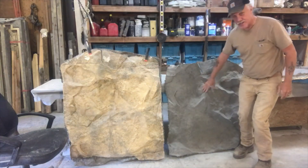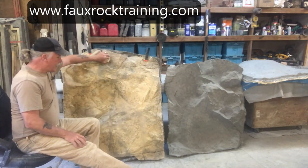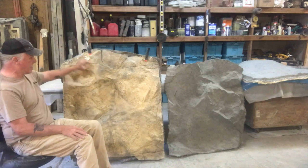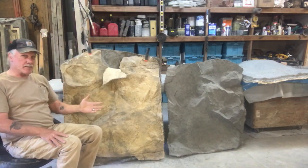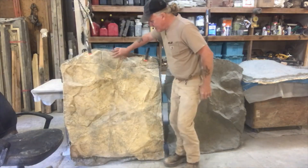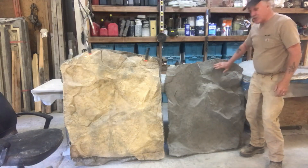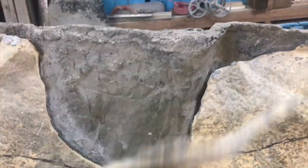This is the casting from this mold, and I just used this mold to make a new mold. You can see a piece of rubber we applied — a paintbrush I was using just set for a minute and came off. The mold is also ripped — that's a big pain in the butt. I still use it and every time I cast I get a little line from that rip, but I knock it off with a chisel and touch it up with a little paste.